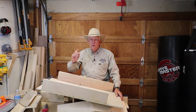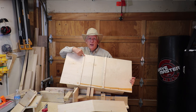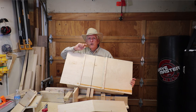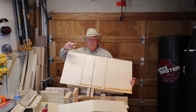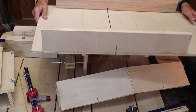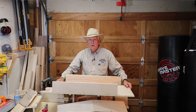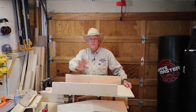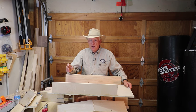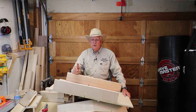One is that your runners that you're going to fit into your miter slots have to be very snug in those miter slots, with no side-to-side play. When you put them down in those slots and try to twist it, there shouldn't be any twist at all. The second characteristic is that they push very easily — no play, but easy to push across your blade. That's characteristic number one.